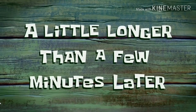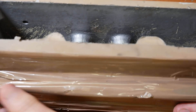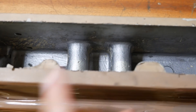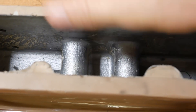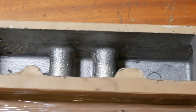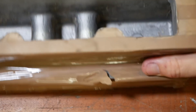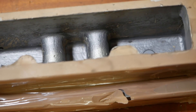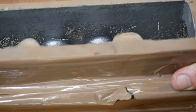A little longer than a few minutes later — the sandblasting has got most of it out. There's still a wee bit sticking to the sides but it's not too bad. To paint this I'm going to need some sort of oil-resistant paint, so I'll probably use an epoxy two-component paint. My original plan was rattle cans, but you can't really get rattle cans in the colors I want — I want a signal yellow. The paint is also very expensive and I'd waste a lot of it just doing a small area. I still need to do the control cabinet and the user module, so it makes sense to buy the paint and spray it. I'm going to need something like Miepa EP100 — about a litre of undercoat, a litre of green, and half a litre of yellow. If anyone knows a vendor in Austria that sells Miepa EP100 or an equivalent epoxy two-component paint in smaller quantities, please drop me a line in the comments.